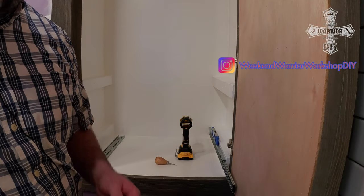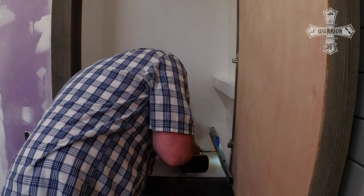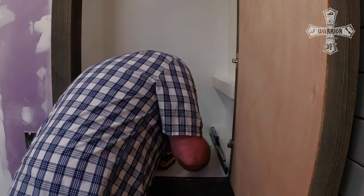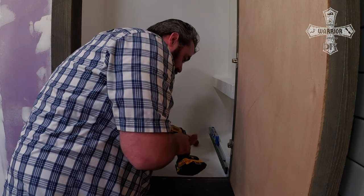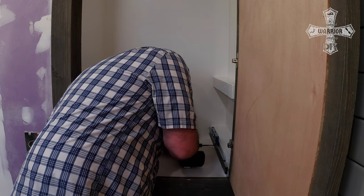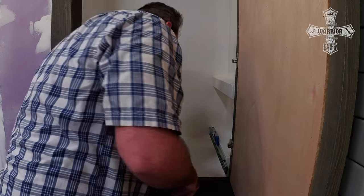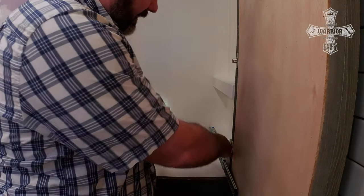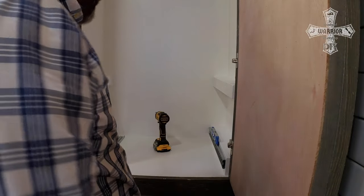Let's get the rest of the screws installed. If I don't poke the hole in first with the awl, the screw just wants to walk on me — it's such a small screw, and the glides are in the way making it hard to hold as you start it. Having that initial hole, almost like pre-drilling, really helps get them lined up and is much easier to install. In pre-planning, make sure the drawer slide is going to clear your door before installing — that's what I had to accommodate here and why I had to add two extra pieces.